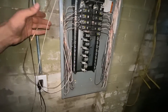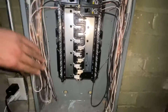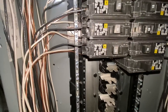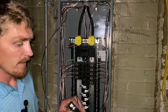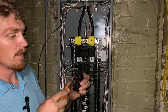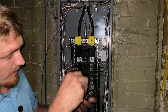You'll want to take what's left of this loop and just kind of tuck it down just like the rest of the wires in your box are. You can see right there is where I tied the ground and the neutral in. Next, you're ready to take your black wire into your circuit breaker — just loosen the screw on the back of the breaker, take your stripped wire underneath the lug on the breaker, and tighten that lug down.